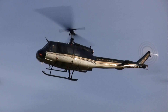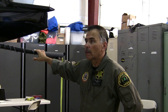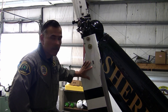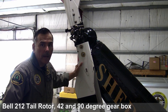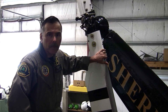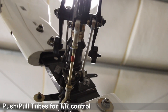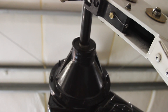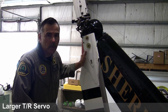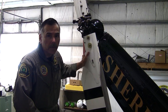On this aircraft, I have never run out of left pedal up in the mountains at high altitude on any operation where we've adjusted our weight and did the rescue. We've never run out of left pedal on this one. Here at the tail rotor system we've got the Bell 212 tail rotor blades, the 90-degree gearbox, and the 42-degree gearbox originally off the Bell Cobra. We went away from the cable and chain from the original UH-1 to control pitch change on the tail rotor system, and went to push-pull tubes all the way from the beginning of the tail boom up to the 90-degree gearbox. To accomplish that, we had to go to a bigger tail rotor servo system. It's been very effective and we've had no issues at all with tail rotor control.